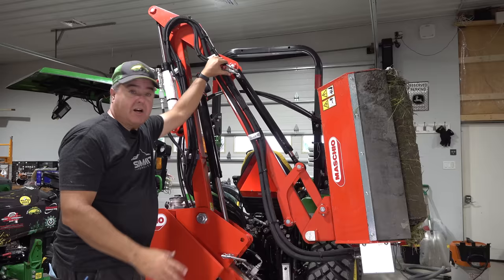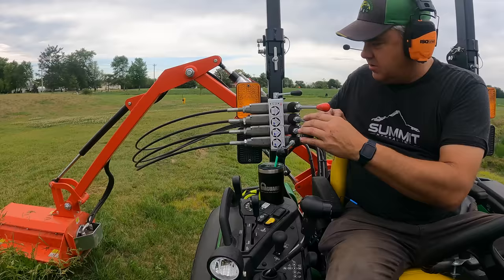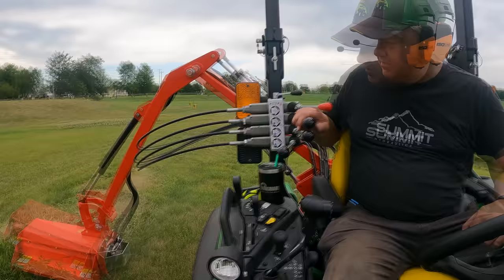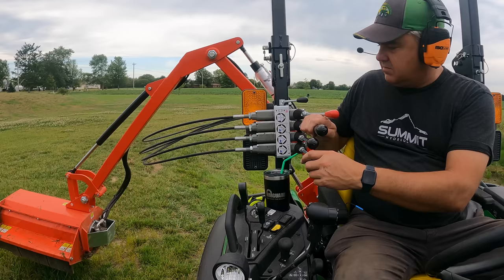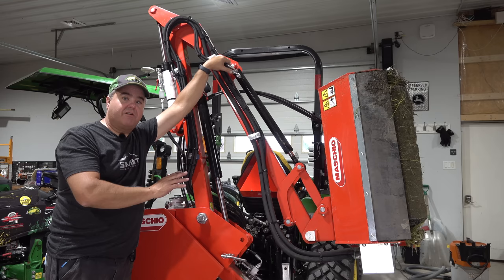All of the hydraulics for this machine are internal to it. There's a PTO hydraulic pump, and the set of levers is attached to the tractor — they're cable-driven, and each of the hydraulic valves is self-contained. You don't need any rear hydraulics on your tractor to operate this mower. All you need is a three-point hitch and a PTO. Horsepower requirements — I'm not too worried about that, because any tractor heavy enough to safely operate this is likely going to have enough horsepower.